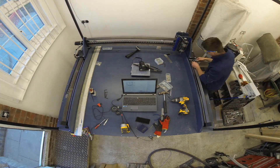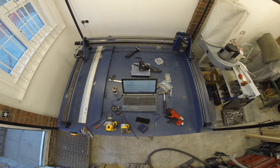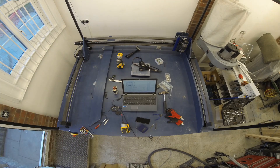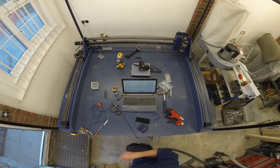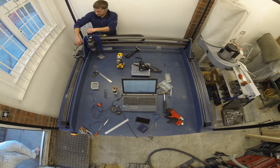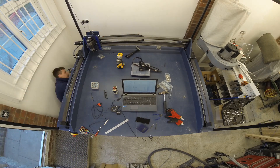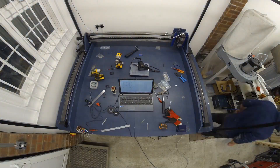It is highly recommended that you produce some dust shields for the ball screws, as any swarf or dust getting into the ball screws could reduce their life. You'll see here the first movements of the Root 4 CNC machine — I spent a lot of time making sure that the commands I was putting in resulted in the correct movements of the machine.